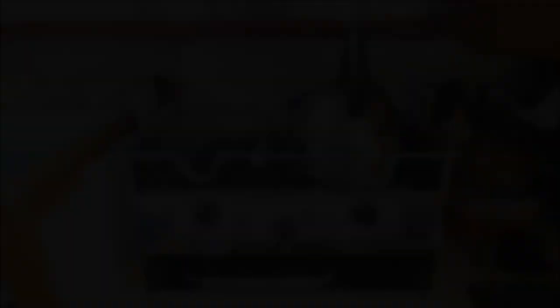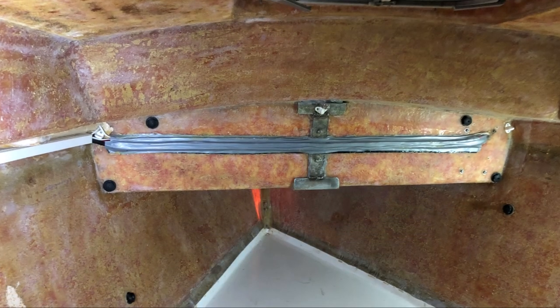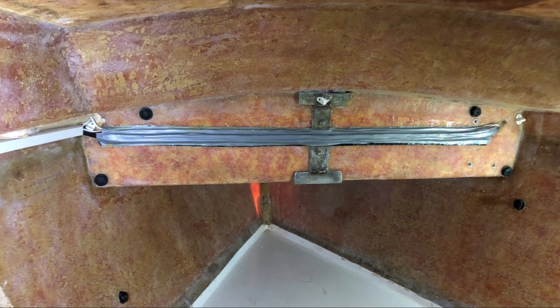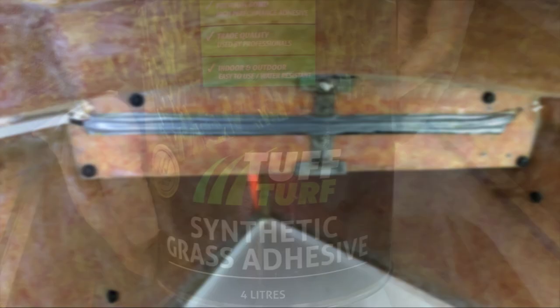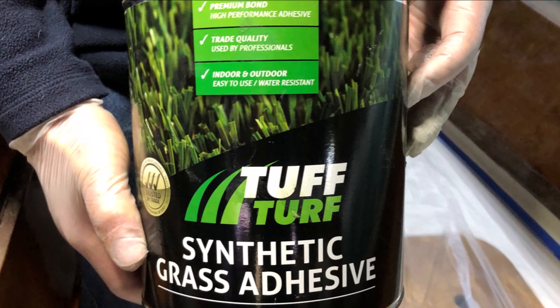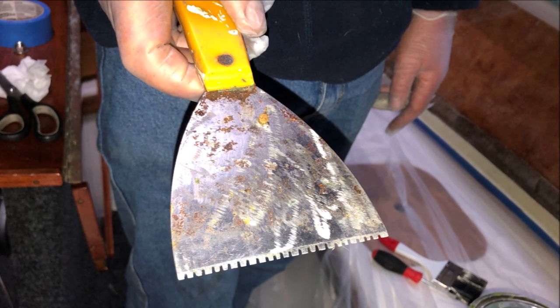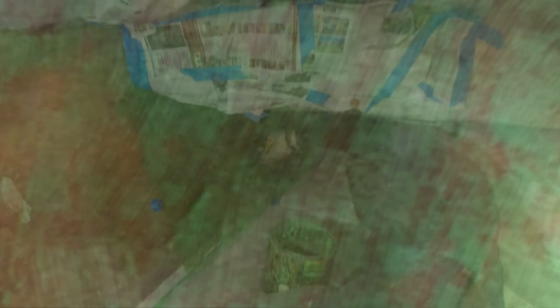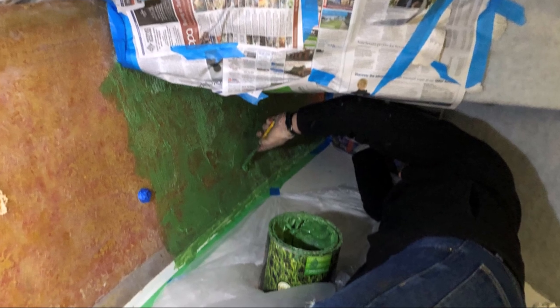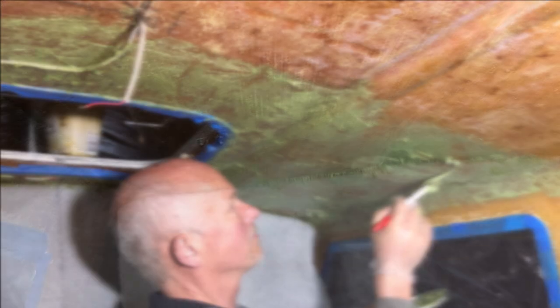With the boat's carpet liner well past its use-by date, we decided to reline the inside with purpose-made hull liner. After removing the old carpet, a combination of scraping, wire brushing and sanding removed the old contact adhesive. Instant turf adhesive was used for its stronger waterproof grip, 15-minute working time, and the need to apply adhesive to only one surface. Ice-grey hull liner from Whitworth's was applied in sections using the old carpet as a template, edges trimmed with a sharp knife, then repeated for the cabin and quarter berth.